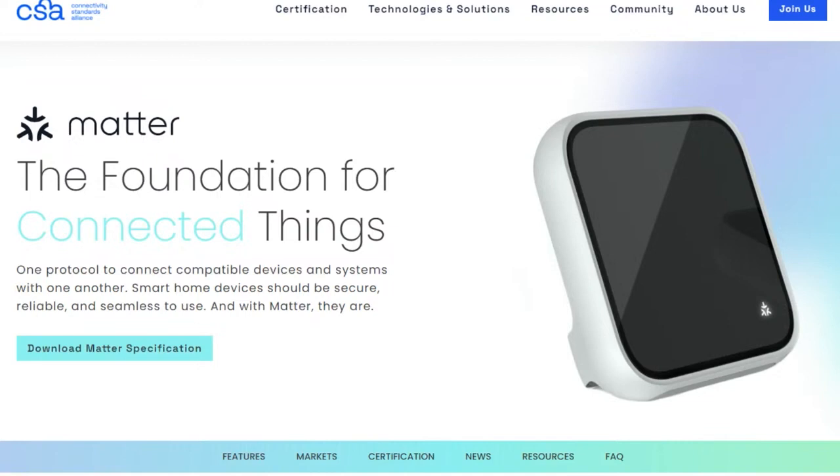The CSA used to be the Zigbee Alliance. Zigbee you're probably aware was used for stuff like Philips Hue lights and other home automation sensors and control boards. For home or office automation, Zigbee is a very common transport because it's extremely low cost, very simple, uses 2.4 gigahertz which is a free-to-use band. The antennas are easy to get, chipsets are easy to get, you can go into low power. You don't have the issue with Wi-Fi where you have to have an access point and password — it's usually done by RSSI location or by pressing a button to synchronize.